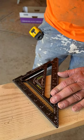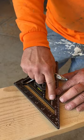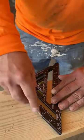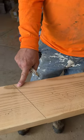So five inches up for every 12 inches horizontal — denoted by the word 'common' on the square. We did not invent this; it's been on the square for hundreds of years. I hold it to the five and draw a perfect 5/12 pitch.